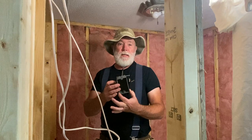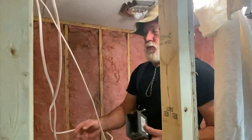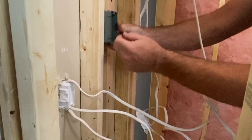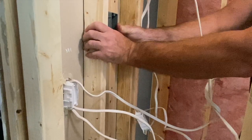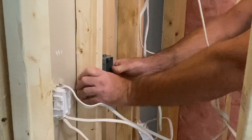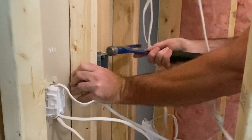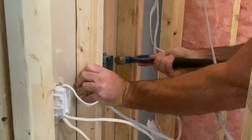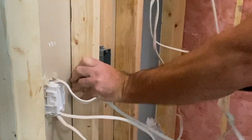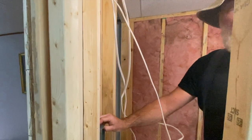This is just a standard switch or outlet box. It has already got the nails in it that are designed to mount directly to a stud. All you need is a hammer to install these things. Over here on this stud is where we're going to put it. You've got these tabs on the side — those push back against the stud. You're going to mount these to your wife's height, not your own. We'll put it about where the other light switch is on the inside of the bedroom. Grab a hammer and tap your nails in. When we get the drywall in and this stud is perfectly secured, this is going to be a much more stable platform for this switch than just having it hanging in the drywall.